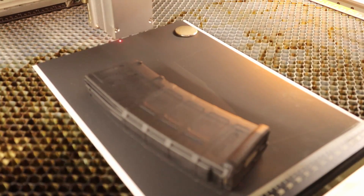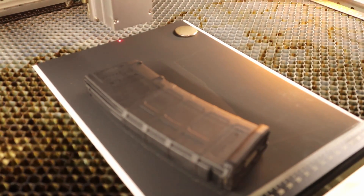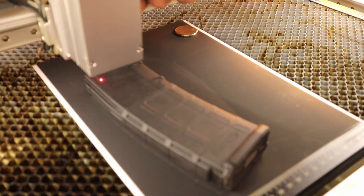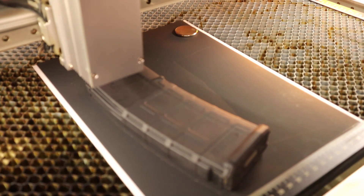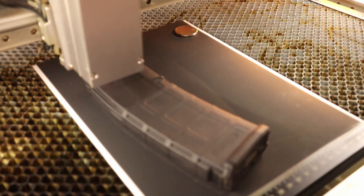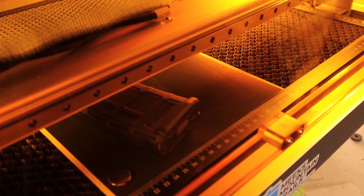At this point we have our P-Mag lined up. Bring the module back over, loosen it, and crank it up — it goes as high as we want since the lid's open. Flip the focusing lever down on the IR module and drop the bed back down into position with the P-Mag, then flip it back up out of the way. We're in focus. Now all we have to do is home the laser and we're ready to go.